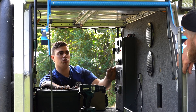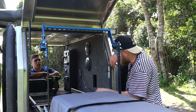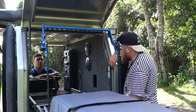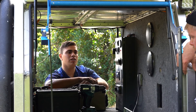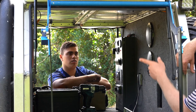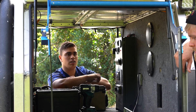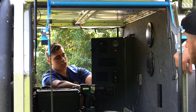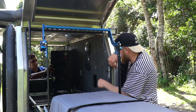I've got a Pure Sine 600 watt inverter — I normally use that for charging power tools. That runs off a separate Anderson plug. The setup is just the one battery — I think it's AGM. I'd want to upgrade it to lithium when it dies. I've had it last three days at camp with the solar panel on top permanently topping up the power. It's run off a DC charger — I've got the DC charger, inverter, and everything in here, plus another fuse block and the plug for the solar.